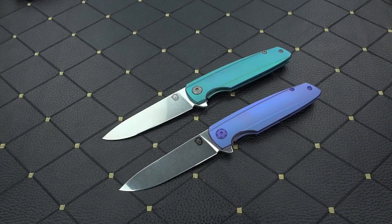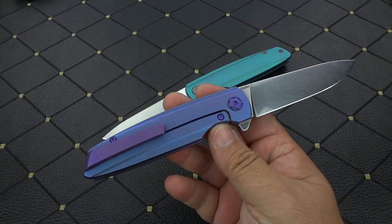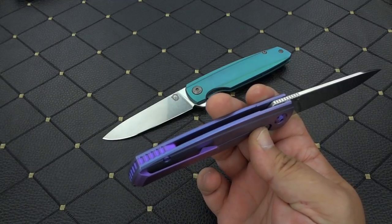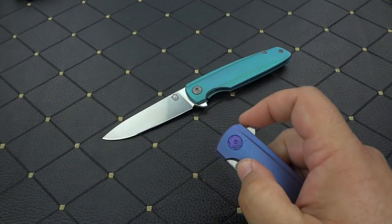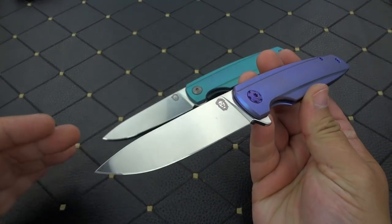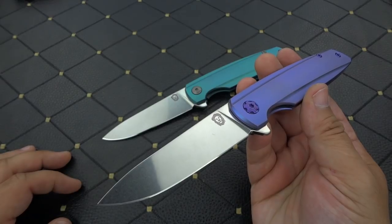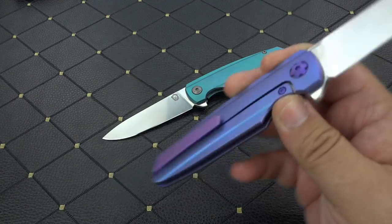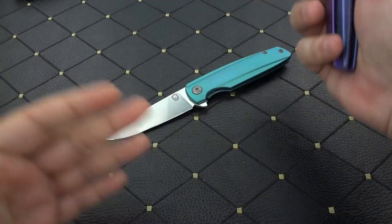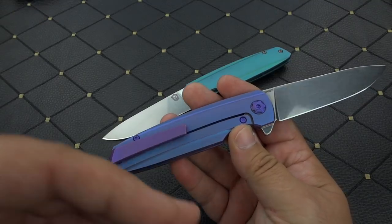Here's how Joe breaks it down. I'm going to try to condense it because he gave a very, very long response, but what I'm repeating here is what he said. First off, he does all of the machining of the handles, the clips, the backspacers, and the blades in-house. Mainly because he doesn't trust anyone else to run at the tolerances that he requires, and he says, honestly, it would be far too expensive to have someone that's that good and pay them to do all of that work. Now, what they do is they send their 4 foot by 8 foot titanium sheets out to water jet. So the titanium starts out 4 foot by 8 foot, sends them out to water jet to get cut to a rough shape. Everything still has to be refined thereafter.